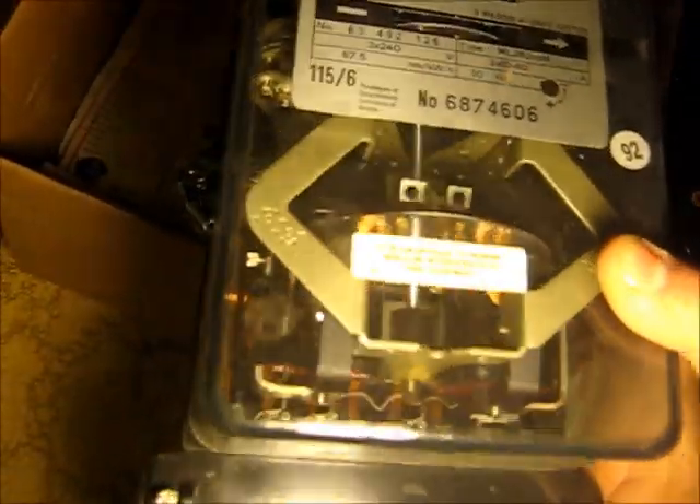10 to 60 up here — I think it might actually be a current transformer meter. Then again, it has got pretty big chunky coils, so it might be whole-current hopefully, because those things are useless without the current transformers. Underneath that — oh, look at that! A WF3S. I've been after one of these for ages! That's an Australian-made British Sangamo HMT with cheap and nasty dial pointers. Tested 1987. It's a 15 to 100 ampere, two-wire, 240-volt, 50-hertz, one-phase, 266 and two-thirds revs per kilowatt hour. I now have the HMT in my collection. Brilliant!